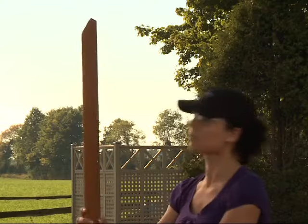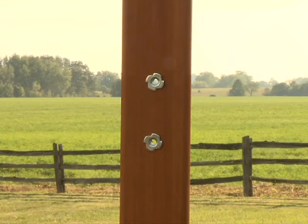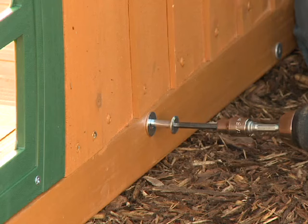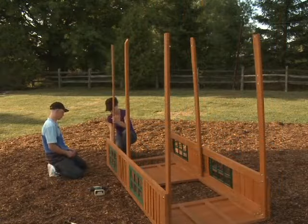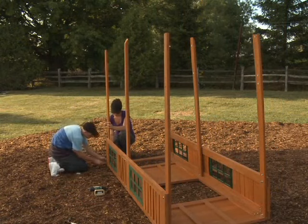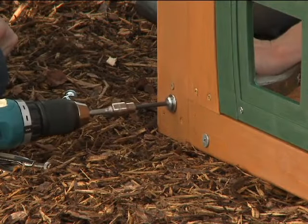Noticing the angled edges of 043 joist sides face towards the narrow window panels and the T-nuts are facing inwards, loosely attach both joist sides to the narrow window panels with two WB8 wafer bolts with flat washer per board. Loosely attach both 042 long wall ties to the tops of the narrow window panels with T-nuts facing inwards using two WB9 wafer bolts with flat washer per board.